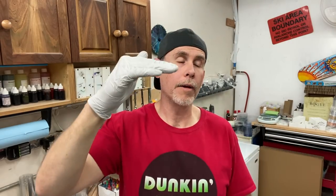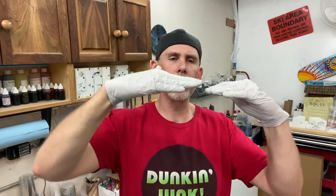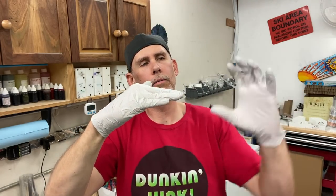But I think one problem I had was I had the cutter too high. And on a spindle, if you're trying to scrape something and you have the cutter too high, it can catch and grab and dig in. The problem is, if it's too high, the roundness, or the edge of it, is going to push out more, and your scrapers tend to dig into it. And that's what I was getting on those bad results.